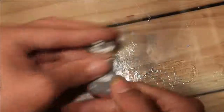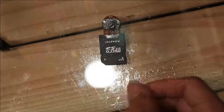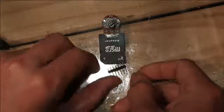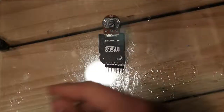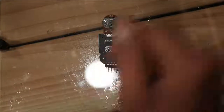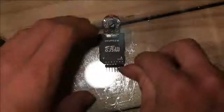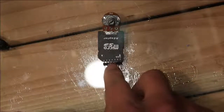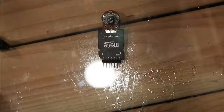So the potentiometer would be at the top here, and you'd have all your connections for the input of the board, the output of the board. Of course, where it'd go to the jacks, it would go to the bypass switch instead. It'd be kind of a point-to-point thing for that. So those wouldn't run through the board because I want to keep the board nice and compact.